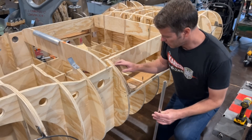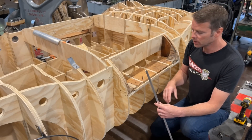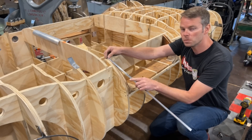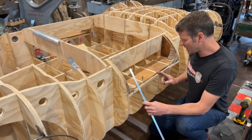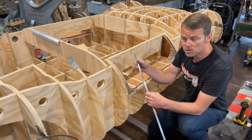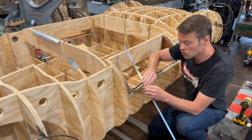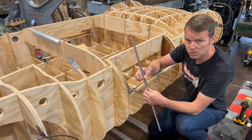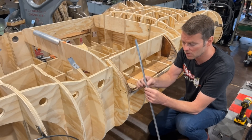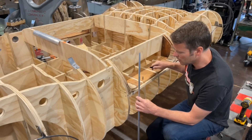I've got the shape of my door opening already sort of carved out. I used some hardwood down in the corners and then just stacked plywood up around the rest of the opening. I'm doing this flange in two pieces — it's easier to butt it together right in the middle than do it all in one piece. I'll use the linear stretching dies on my old Harbor Freight planishing hammer. What the linear stretching dies do is open up one side of this angle material, putting a radius in it because we're stretching or thinning the material.